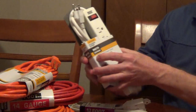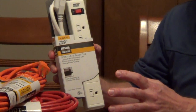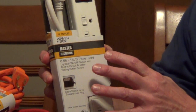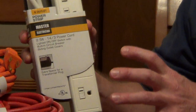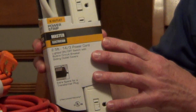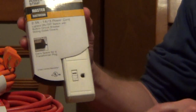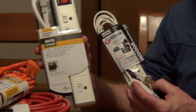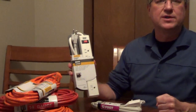But if you're looking for something more permanent, this is really what you're looking for — a power strip or a surge protector. For a power strip, you want something that's grounded and you want something with an internal circuit breaker. This will actually allow you to use up to 15 amps and it's much safer than using something lighter like this. So a couple tips, and underneath the video I'll put some more additional information.